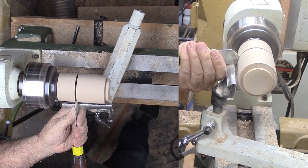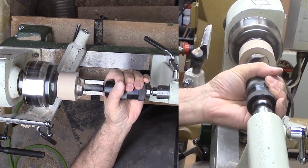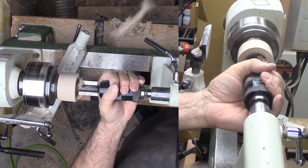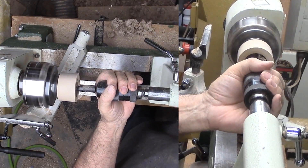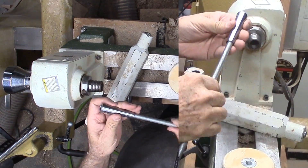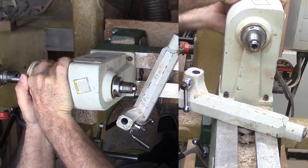This wood is gum harvested from my yard a couple of years ago. Previously I roughed it and cut tenons on both ends. Now I need to part my cylinder to form a top and bottom. I'll drill the top with a Forstner bit. The thread and cutter will make the sides parallel before it's finished, and a Forstner bit inherently cuts parallel sides. I treated the interior with a good dose of thin CA glue and let it harden thoroughly. Time to assemble the cutter into the lathe spindle — the collet must be held with a drawbar. Not using a drawbar is asking for an accident with a bad ending.